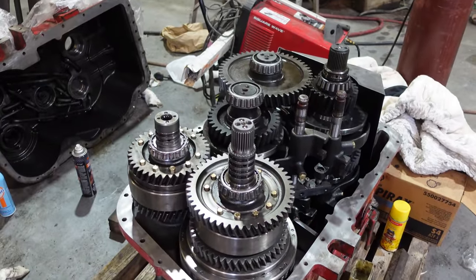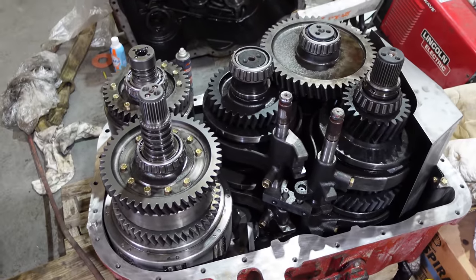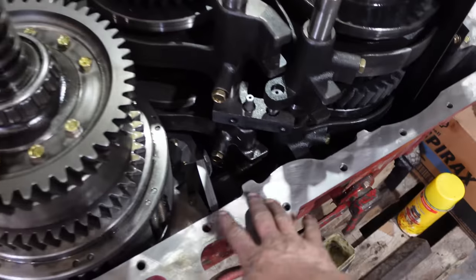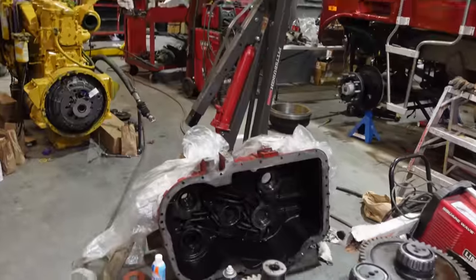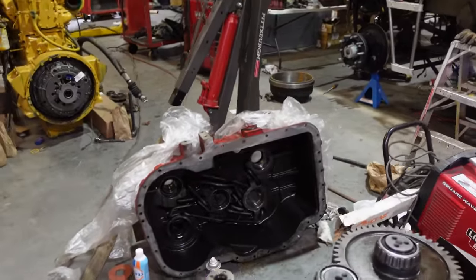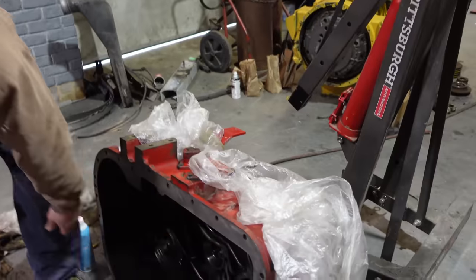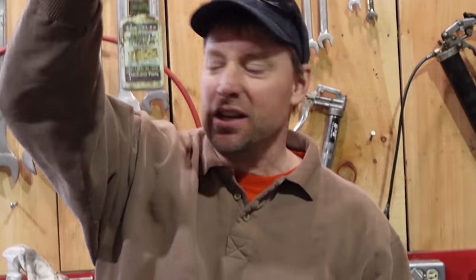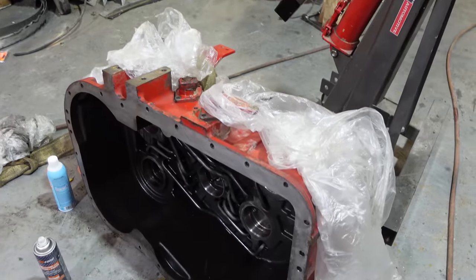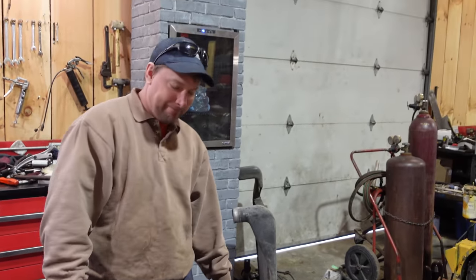Last shaft in. Nice. That looks really nice. Does it look like it's going to work? So I took a sharpening stone and just cleaned up the case. We can clean up the top cover yet, and then we can plunk it on. Okay, and what did you Loctite? Some of these races were a little spinny, so I used this retaining compound, 609 green. It's meant to turn slip fits into press fits. Oh, okay.